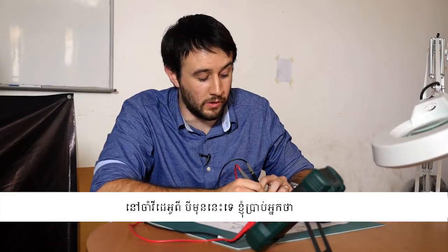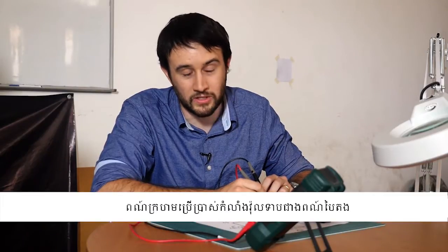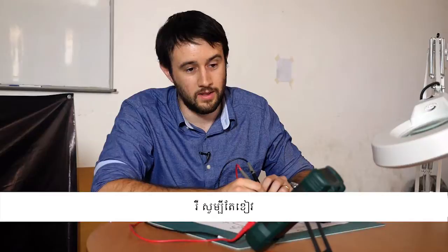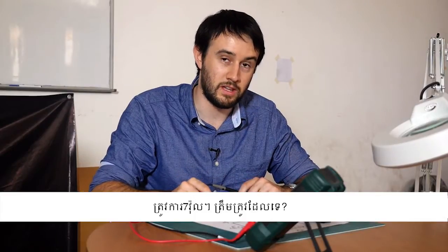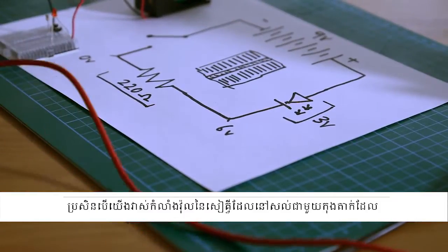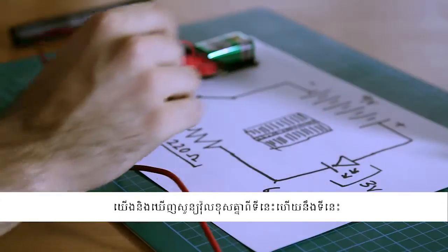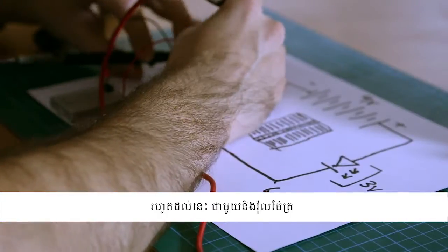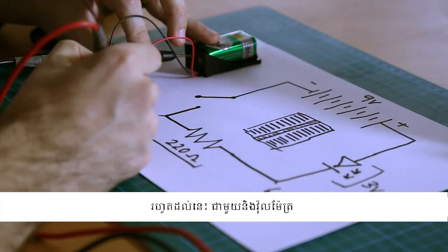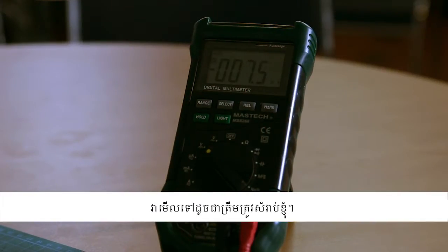A couple of videos ago I mentioned that LEDs have a voltage use that changes by colour. This is a red one, and red has a slightly lower voltage use than green or even blue, so two volts is about right. That means the rest of the circuit must be eating about seven volts — nine minus two makes seven. If we measure the voltage of the rest of the circuit with the switch open, we expect to see zero volts, because if no current is flowing the voltage can't drop. Measuring from that terminal out to here with the voltmeter, it's very close to zero — only a couple of hundred millivolts out, which sounds about right.